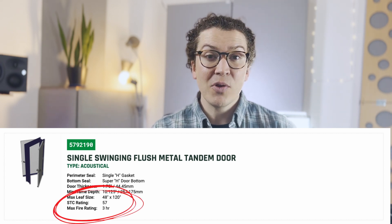However, the highest-rated soundproof door from a reputable supplier named Overly — also recommended in Roger Weiss's book — only achieves an STC of 57. If you use green glue in your walls but install a door with an STC of 57, your door will still transmit more sound than your walls, which defeats the whole purpose of using green glue.